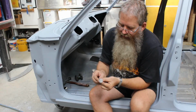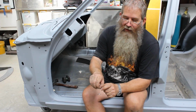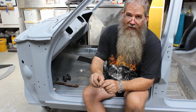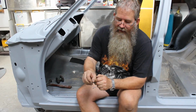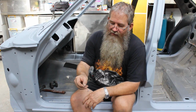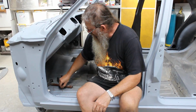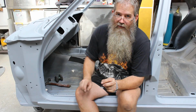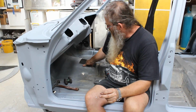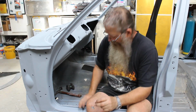So the whole idea of that is that the nail needs to be welded on there pretty good. You can just TIG weld a nail or a piece of welding wire on there, but welding wire won't work so well because it'll be too soft. This is a proper dent pulling nail. If you don't have that, you can use a carpenter's nail, use whatever you want. And in short, you can fine tune this. This is 1.2 mil thick steel. The steel on the car and the floor pan here is around about 1 mil, and it varies because it's all being pressed into shape.